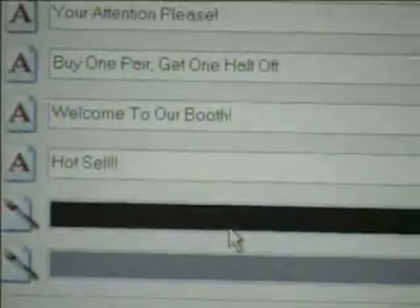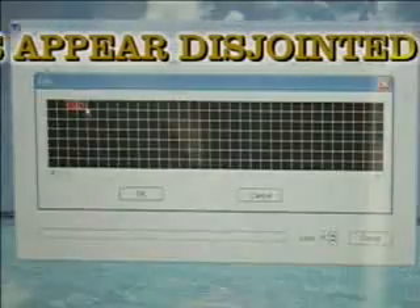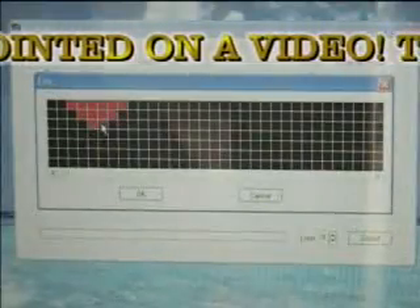You can control the brightness of the illumination of the LEDs — the lumens. The last two lines of programming can be programmed in vector format so you can add your own custom shapes to scroll along with the words. On messages five and six, you can fill in the box to draw an icon. Right-click on the shaded box and press clear to remove what's currently there, then right-click again and choose manual edit. In this screen you can draw what you like, and the shape will scroll along with the words, making a bigger visual impact — like this sample message for a sports bar.